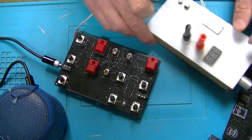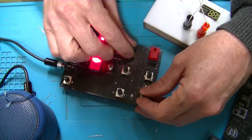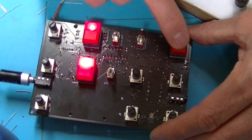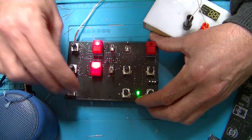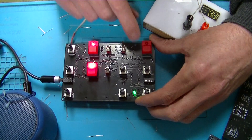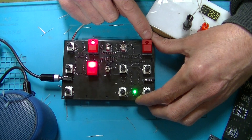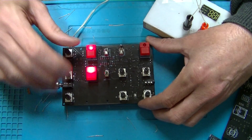I've plugged in the speaker and a little power pack. That's not right — there should be a light on here. The echo reverb's working because that's the feedback. I must not have connected this switch up properly because there's no LED on. Alright, I'm going to try and troubleshoot this little synth and I'll get back to you.